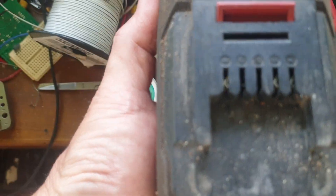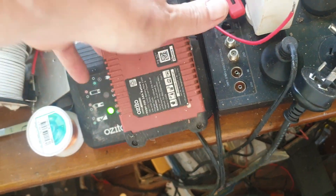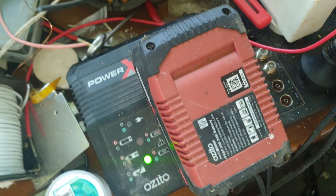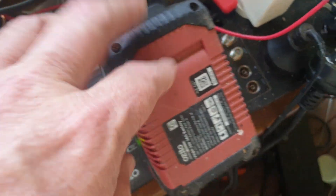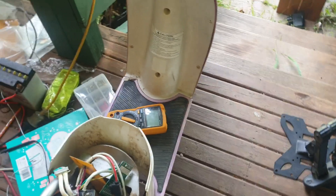So this thing is being charged at a bit over 18 volts, making the plus end of the battery pack get too hot. I've got a failed one of these somewhere and I'll pull it down and do an autopsy, and I'm betting we find just one cell that's damaged.